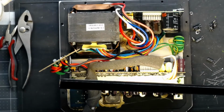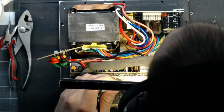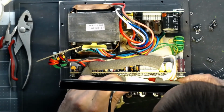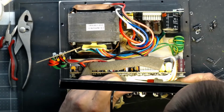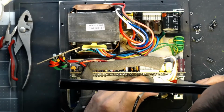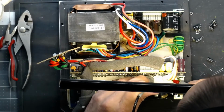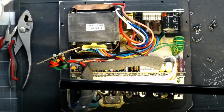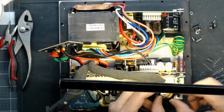So here we go. So we're conductive on the plate. Now let's go to our first device. So our 2 devices are electrically connected together. That's good. And we're checking the center leg. We're not going to the plate. So now we'll go to the other ones. We're not shorted in between the devices. And now those 2 are connected, but not to the plate. We're good. No shorts. And it's more of a sanity check than anything. You don't really have to do it, but I don't want to take this thing apart. It's already been apart. I want this thing to turn on and make a nice clean sine wave that I can show everybody.